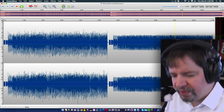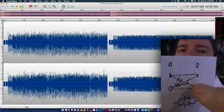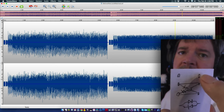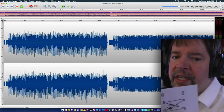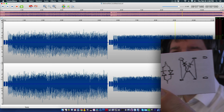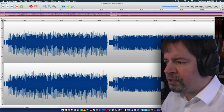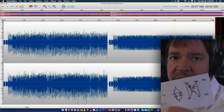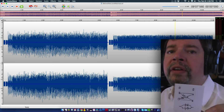We have a whole other coil here. We're running the whole signal through this, but there's this other coil that's not connected to anything. If I short it, it will change the induction characteristics of the transformer radically. It will cause it to resonate more easily, be kind of less obstructed. And here's what the Giraffe audio unit does.